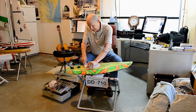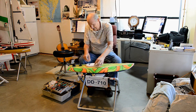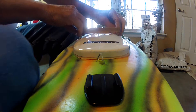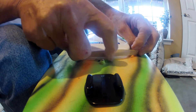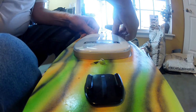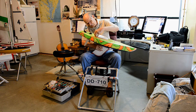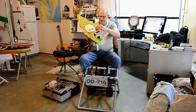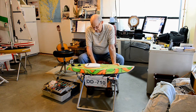To install this one, it's easy without the mast on, that's for sure, but I don't find them that difficult even whenever you've got sails on. If the hands get a little wet, that can make a difference, but they still go on pretty easy. You want to make sure that rubber band is all the way down to ensure the best possible seal. I always check it all the way around because it's easy, where you're not looking, to have it lift up a little. The way that's on there right now, it's ready to go — I wouldn't give it a second thought.